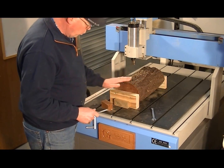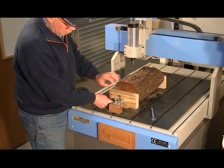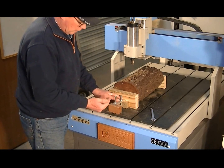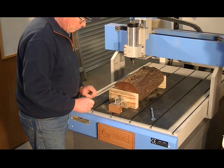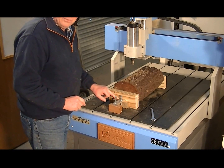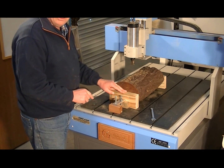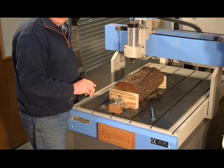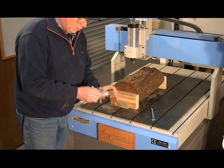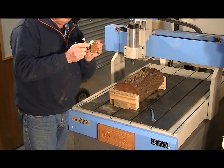When clamping a piece of wood to a CNC bed it's quite important to have the clamping bolt up as close to the work as possible, and the supporting block out as far as you dare. This block needs to be the same height as the block you're clamping down, if not a little higher — but the block you're clamping should never be higher than the end. The actual trick is to get the nose of the clamp to clamp down in this fashion, not that fashion, because it can work loose and spit the dummy.